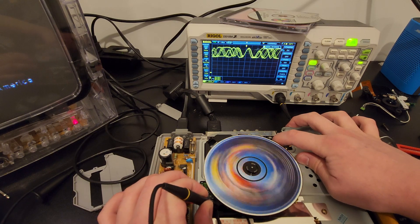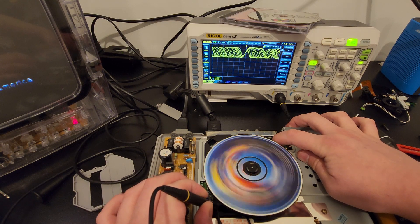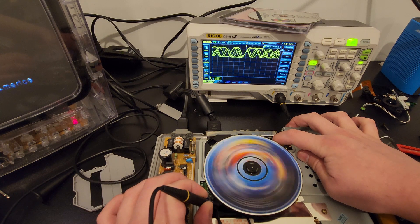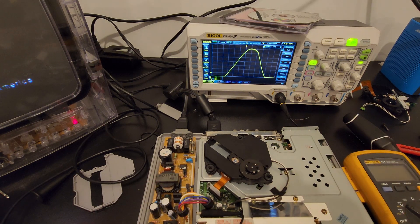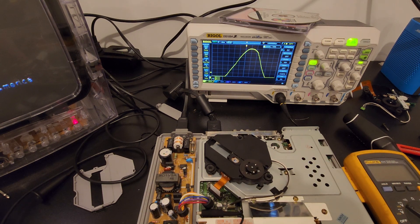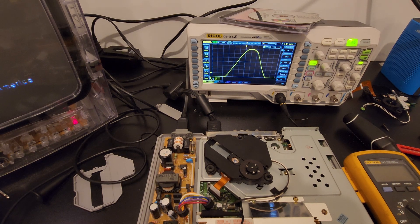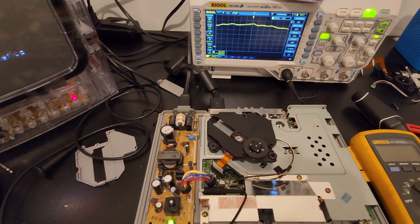That's where I'm stuck at right now. If you have an idea for what I can try to make this better, feel free to comment down below. If you think it's just a junk laser and I got ripped off on eBay, feel free to make fun of me. I think at this point I'm probably just going to call it quits. Maybe I'll try to replace some of the caps responsible for the power supplies of the disk drive — something involved in filtering the supply for the motor may be bad, letting ripples from the motor's current consumption get onto things like the laser data output. Maybe I'll try that at some point, but I'm kind of fed up. I figured I would just make a video and show how far I got. If you made it this far, thank you very much for watching — hopefully you can learn a thing or two from my mistake.